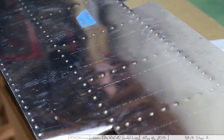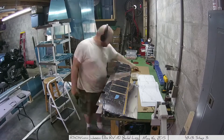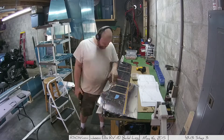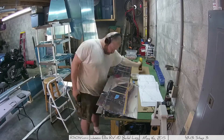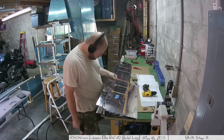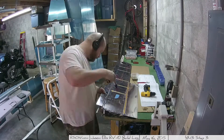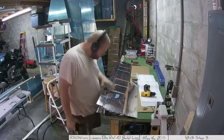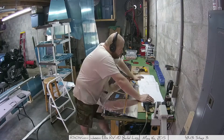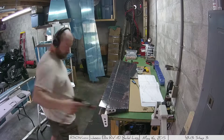This picture kind of pointed out another problem - there's a lot of pillowing going on with my riveting. Come to find out it's not actually due to the riveting. I assumed incorrectly that I was just pushing too hard or doing something incorrect, and come to find out I apparently have not been dimpling deep enough. I assumed I was doing it correctly because all of the rivets fit perfectly flat down into the dimple and everything looks great, except that pillowing implies that my dimples are not actually pressed in deep enough.